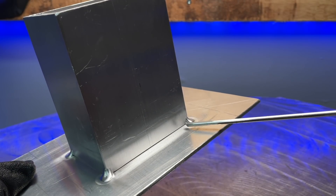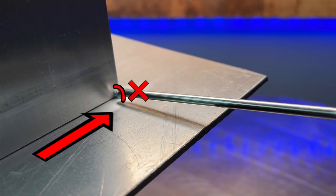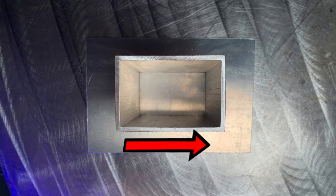So when setting up, why not place them on the corners instead? We can keep them relatively small, get some good heat and good filler onto them, and use them as a proper point to start and finish a weld from. We'll put a little bit of filler and a decent amount of heat into that point, which is even going to warm up the piece a little bit for our start. Another added bonus to having them at the corners is that by the end of the pass, my weld is going to be extremely hot — having your tack at the end provides a little heat catch, preventing me from totally overheating.